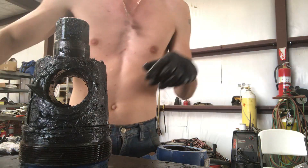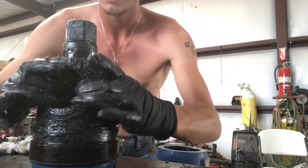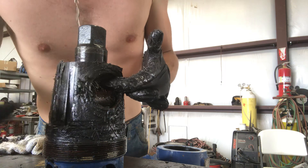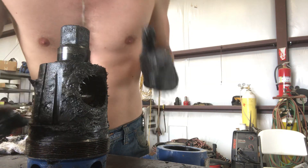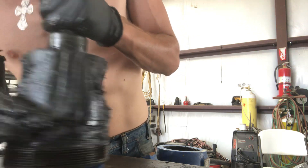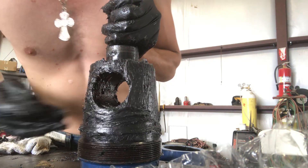Fill on the inside, make sure you're lined up with the hole in your plug. Do the same thing on the opposing side, make sure it's lined up, grab it, squeeze it together, check your alignment. Now that we've got it all put together, see on the side of the sleeves — got some grooves right here. These grooves in the sleeves, you don't want to put any grease in there, or not very much — try to keep them pretty clear. You'll see the slit on each side of the sleeves around the plug — just take grease and fill those up real good. Take grease and go over the entire top of the sleeves now that they're installed, just a nice slick coating, fill up all your crevices where the sleeves meet the retainer.